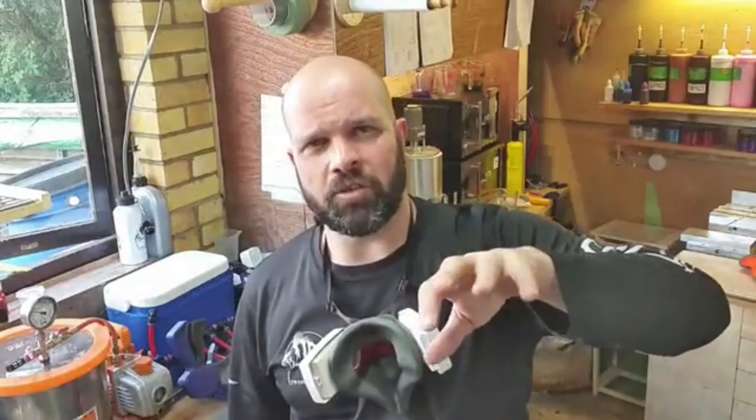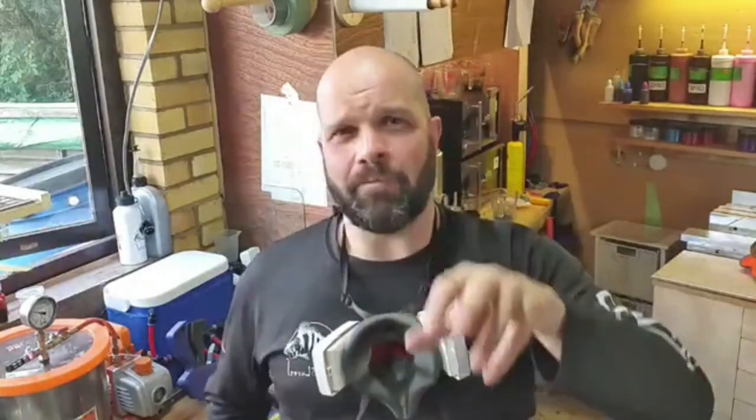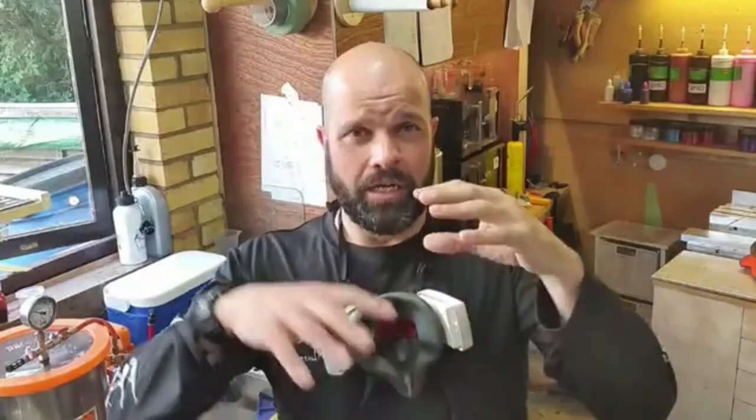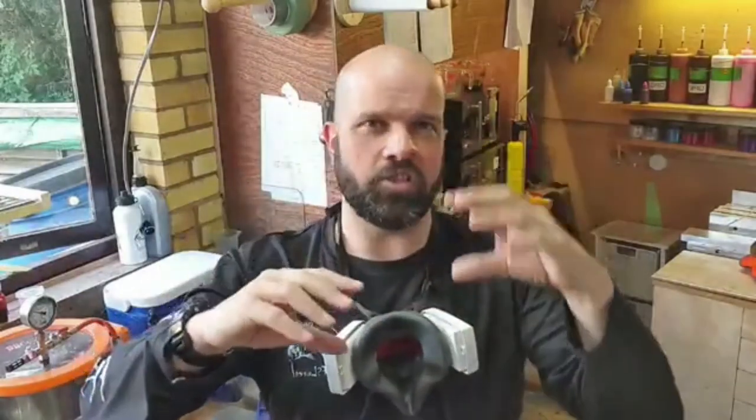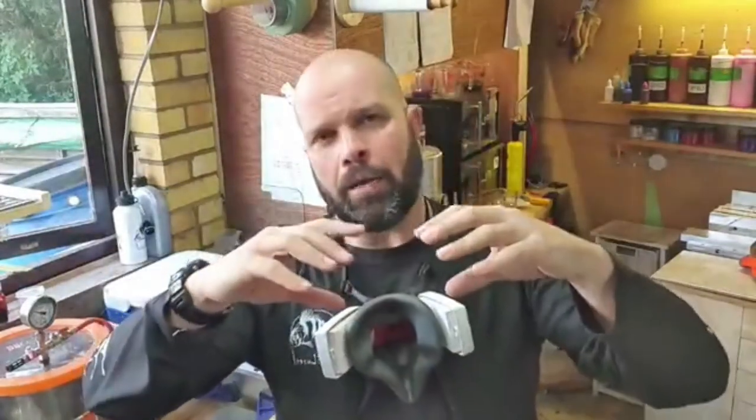So the task was set, and it took a long time for me to get a bait that I wanted to send out. That was why it was really a pain in the ass, because it was really blending lots of colours, it was powders, what glitter to put in, how much to put in. And when it came to shooting it, if you add powder, that plastic is now thicker, so you've got to make it hotter to make it the same viscosity as the other plastic without it, and it can go horribly wrong, and it did.